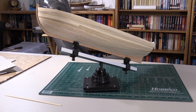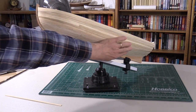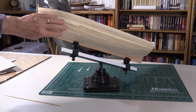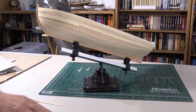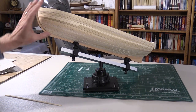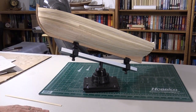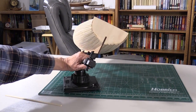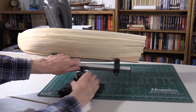I finished planking the boat. I ended up spiling the wood all the way down through to the bottom — just the front section — and then I put the rest of the wood up and tapered it down to the back. No spiling needed back there. It actually came out quite good. I'm quite happy. There are some errors, but I got better as I went down. It's pretty smooth — the sanding job will be much less than in some of my other boats where I had that clinker style sticking out. There are still some issues at joins where I was a little hasty, but I'll sand those down. I have to trim the ends at the back and prepare to put some mahogany up there. But first, I think I need to paint it.